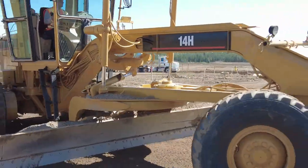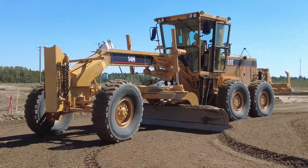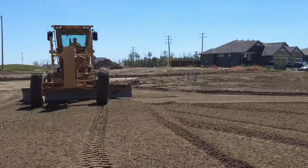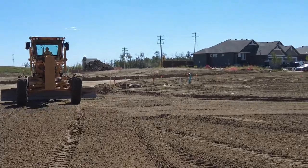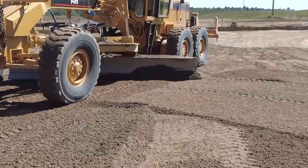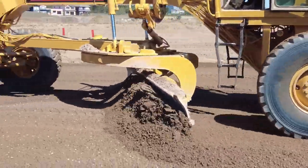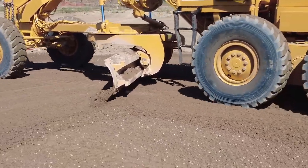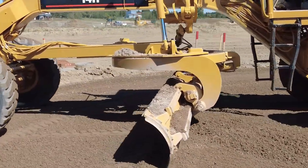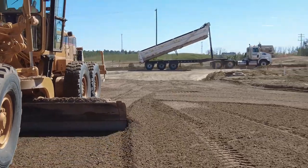I'm not really finishing this bubble because the curbs aren't even on it yet, but when I'm finishing it, this is basically what I'll do as well — the same kind of action. I make two loops and now I steer out, erasing my tracks. The crown will roughly be in there because I've been working on it as I've been blading this. Usually these bubbles end up being about 3% slope from the outside perimeter to the crown. Now I lean my blade ahead a little bit and drag this backwards — I'm not only grooming up my tracks, I'm also adjusting the grade of the crown here.